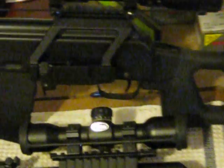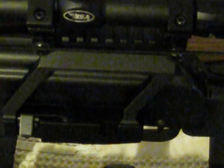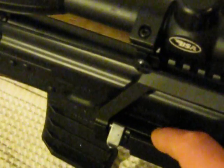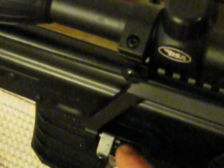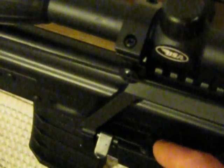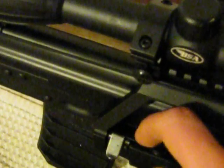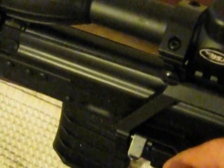Haven't got a chance to go out and test it. But just to let everyone know — hopefully you can see this set screw right here. The actual set screw is actually under this screw, because when I got this one I thought that was the set screw so I kept tightening it, but it's under that. You have to unscrew this to get to it. Then there's a square piece — you have to move it forward, then put this piece back on and then put that screw back in.